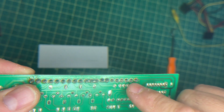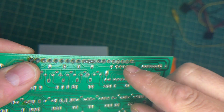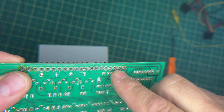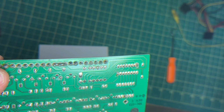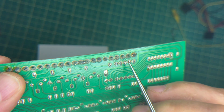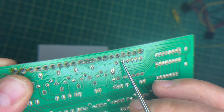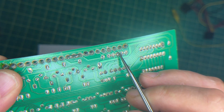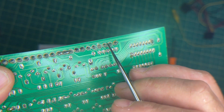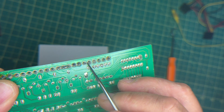And also of significance is make sure you obviously don't bridge solder where it's not supposed to be bridged, but make sure you clean up your work. So what I mean by that is you're going to get some solder splash and stuff between these things. So you want to make sure you clean them out. I think you can see what I'm doing here. Just to make sure that none of this...